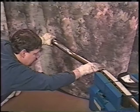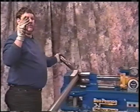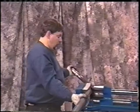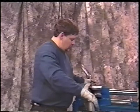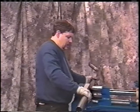The one thing we're going to adjust for is the muffler usually on most vehicles kicks to the outboard side so it gets away from the drive shaft. So we're going to rotate that pipe up just a couple degrees, and then we'll look over the top and make that offset equal so that it's parallel. Okay? We'll note that that's less than 20 degrees because when you pull a bend this tight together, it will pull a little bit of bend out of here.